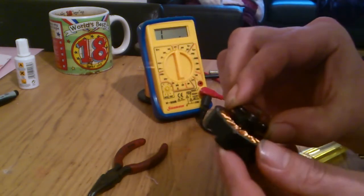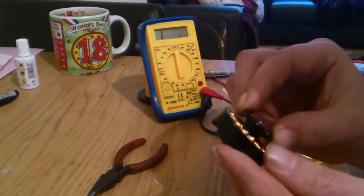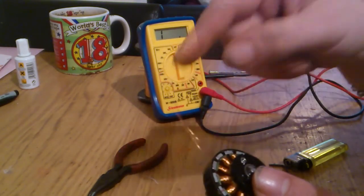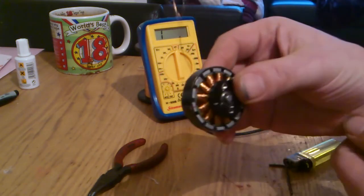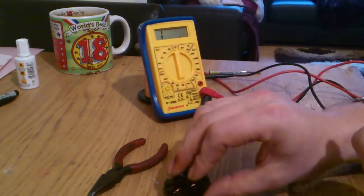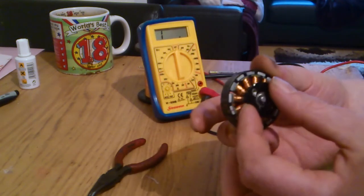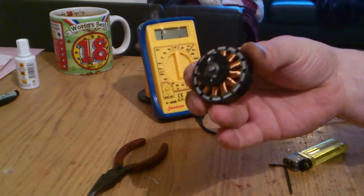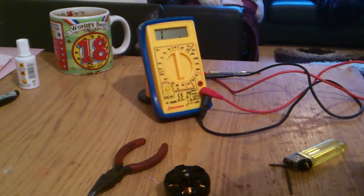If I had the motor controllers, I've seen the gimbal controllers, the wires are pretty long on them, so you could probably take those wires straight to the motors and do the same thing: solder them on, heat shrink them, cable tie or a bit of epoxy. So finishing the ends, making the ends off, is totally a personal thing. So there you go, that's how you do it. Feel free to add any epoxy if you think any of your coils might come free. But that's it, you've rewound a brushless gimbal motor.